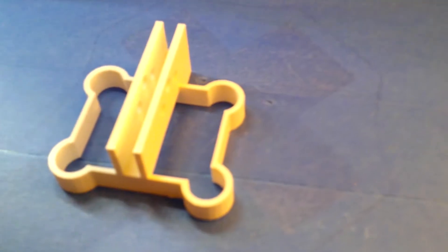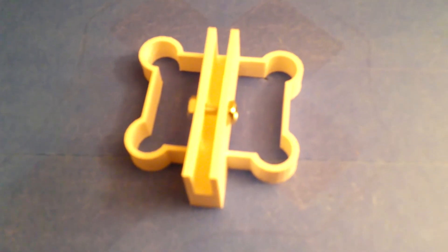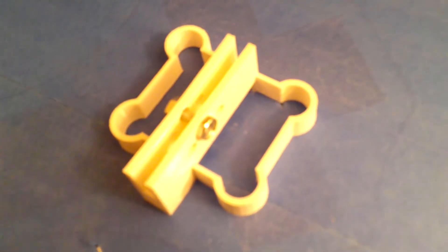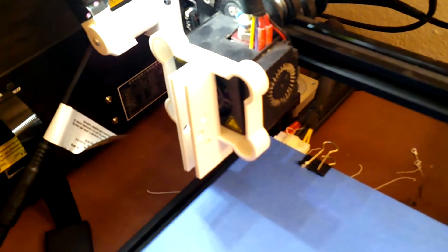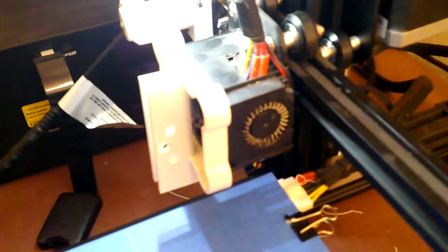The part has three holes to mount the indicator to. Here's another view of the printed part and the required screw and nut to hold the indicator to the holder. I've chosen to use the center hole because I want the indicator to stick out from the holder. Here's a view of the holder on the extruder without the dial indicator or the mounting screw. The fit was pretty nice right off the printer bed and just required a slight press to place on the extruder.